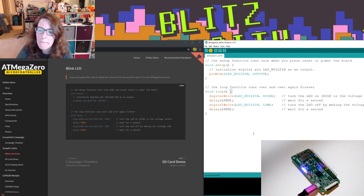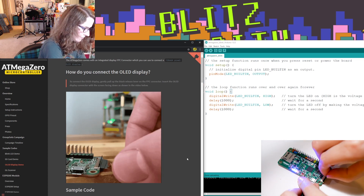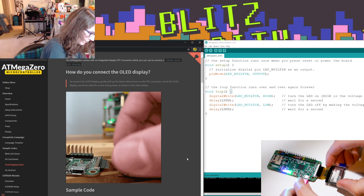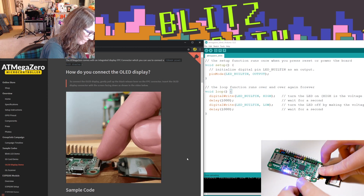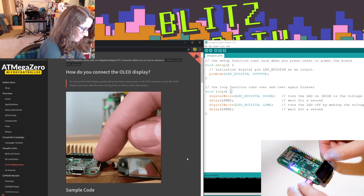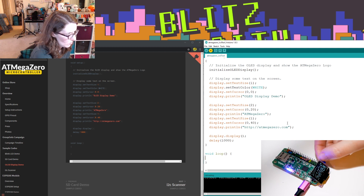We've got the Hello World Blink, and it works as expected, blinking away the onboard LED. Good sign. There's also some OLED example code, which includes images for how to properly attach the screen — something that I personally always need. You do need the Adafruit SSD1306 library, which requires the Adafruit bus library, but then you'll get that nice logo going on the OLED.